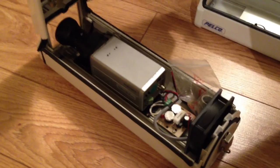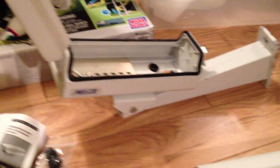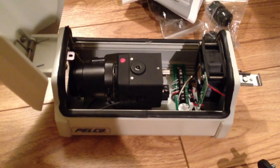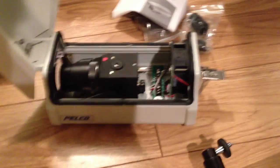Going back to the cheaper Samsung one — it has a camera in it with a 100mm lens for long-range zoom, and the same circuit board minus the fan that I put in the Pelco. Ideally I'd like to get a Pelco heater kit but they're very hard to find, so it's better to get an old enclosure and keep the electronics. This is what one looks like bare, without anything in it. These smaller 8-inch ones are for compact cameras — I have a C10DN-6 high-resolution low-light camera with a 5-50mm Computar lens on it. They are spring-loaded so when working outside, the housing is not going to be flapping around.